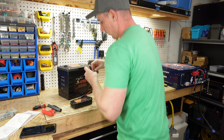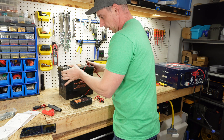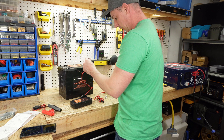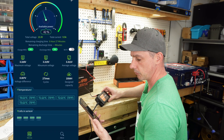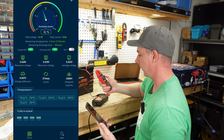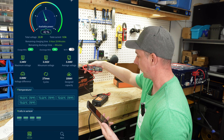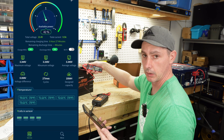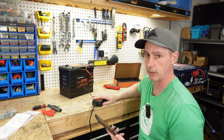Nonetheless, we're going to put a lug on as if we were connecting it with a trolling motor. That's tight now. So they give long enough bolts as if you were going to be connecting the charger with something else. And I'm seeing 9.5 amps going in. We have 9.47 and 9.5 on the clamp meter, and 9.5 on the app — so we're within range.